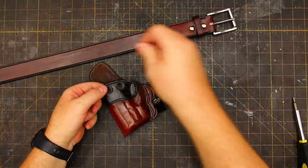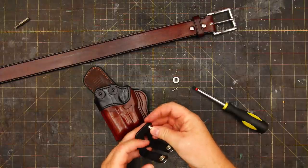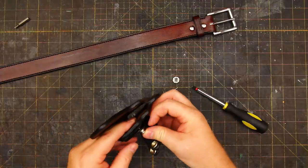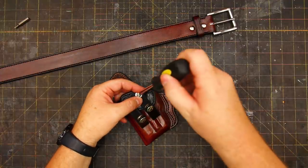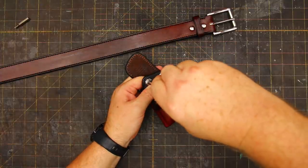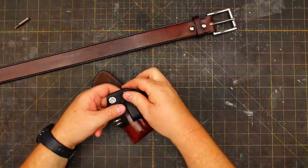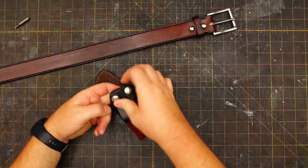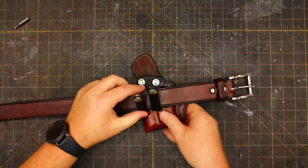In case you're wondering about my snap hardware, I'm using 6/32 1/4-inch Black Oxide T-nuts for the snap post, and the rest of the snap hardware is from Pull the Dot. The screws are 6/32 thread, 1/2-inch long stainless steel with an undercut flat head to help them recess into the snap studs a little bit better.